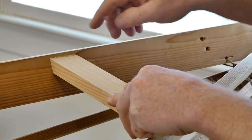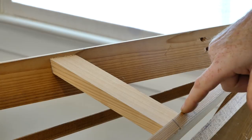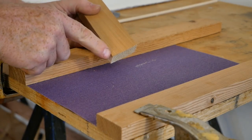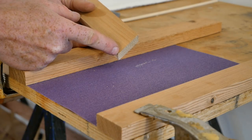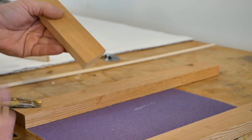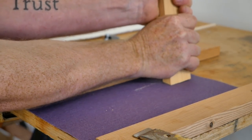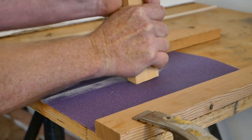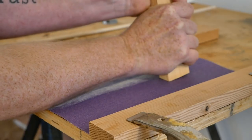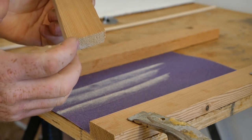The next thing I need to do is check the fit. With any butt-jointed dowel deck beam, you have to have perfect fitting all the way around. Right now I'm seeing a little bit of a gap at the back — this is exactly why I really don't like to do butt-jointed deck beams any more than I absolutely have to. I need to take a sixteenth of an inch off this corner without rounding it over and without disturbing the entire plane of the end of the deck beam. The way I do it is clamp down a piece of sandpaper to a table and use both hands to pull it flat — if you just try to rub it with sandpaper in midair, you will end up rounding it over and everything you try to do to make it better will just make it fit worse.